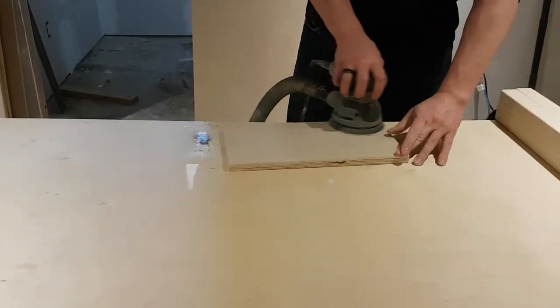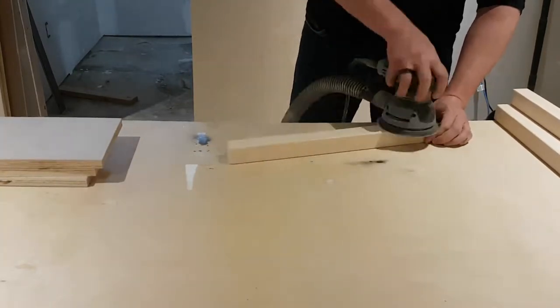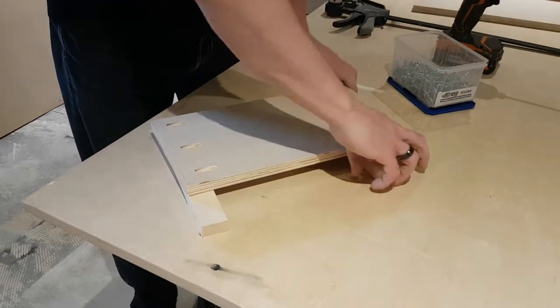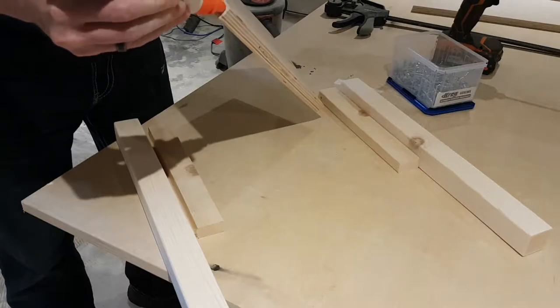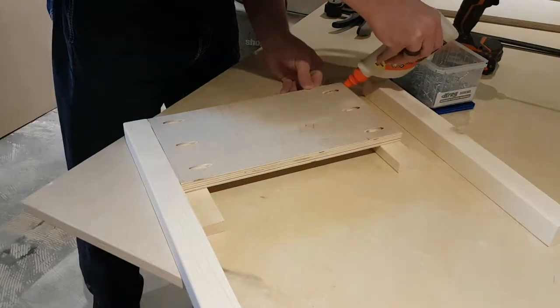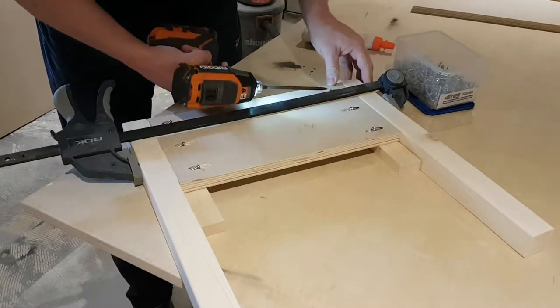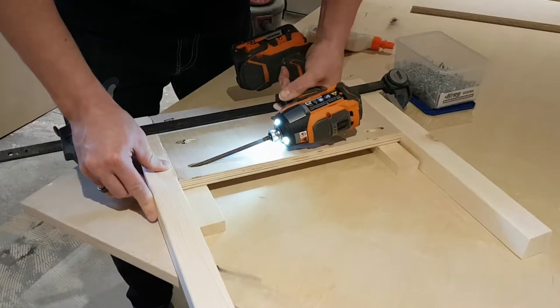You should be left with all the wood for your frame. I'm just giving everything a quick preliminary sanding up to 220 grit. Make sure you don't go through the thin veneer on the plywood — just buzz over it real fast. On the legs and the one-by-twos I'm starting off at 80 grit and working my way up to 220. From there, take some three-quarter inch spacers and place them underneath the plywood panel, run a bead of glue on each side, clamp everything in place, and add your pocket hole screws. You'll have one side and two legs done in an instant.